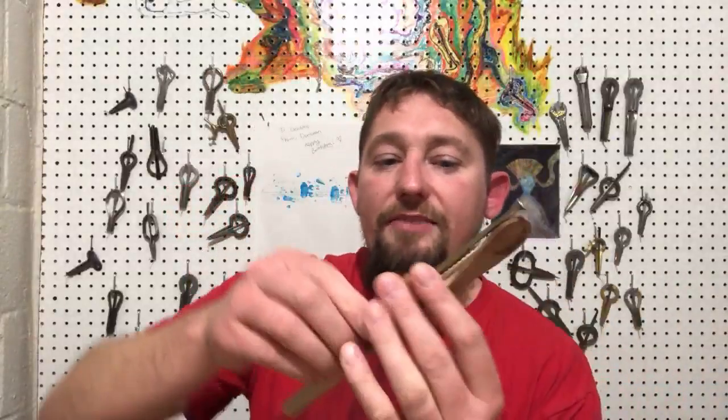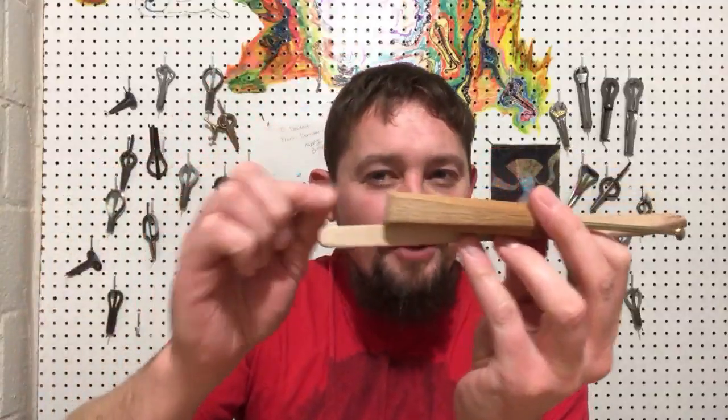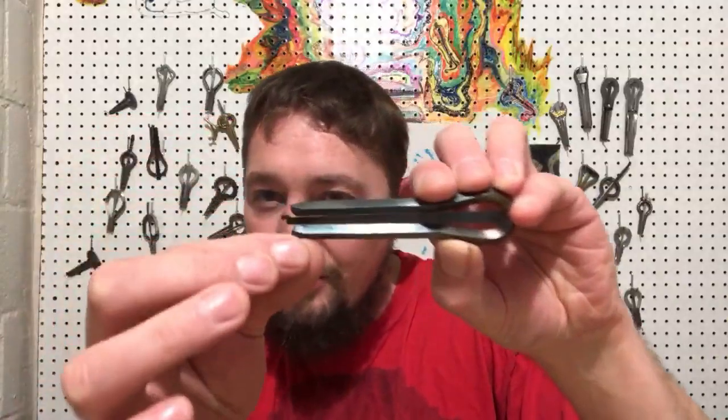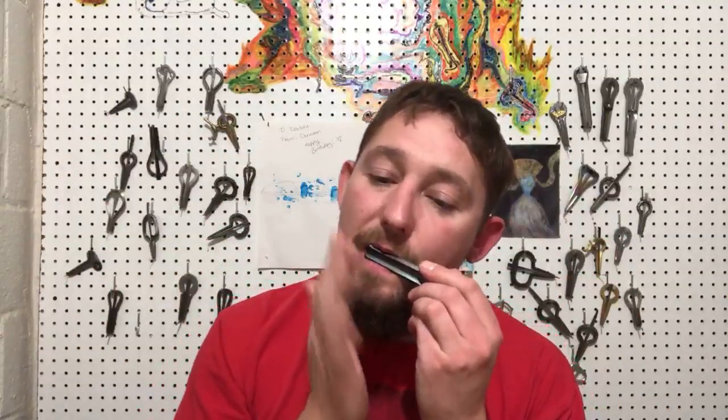And that makes for a harp that plays more stable, because if it compresses unevenly at the tips especially, that's where you get the most side deflection in a reed. So a lot of times I'll flare the tips out just a bit and then give it a relief cut too, so you have a little bit of forgiveness when you're playing a harp fast.